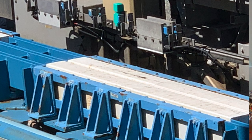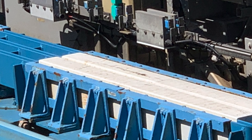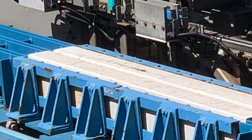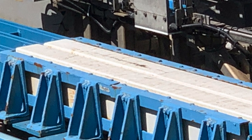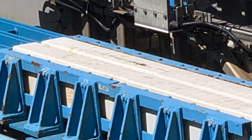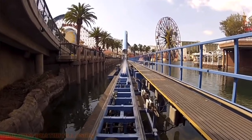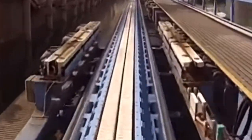The last step of construction on those is the outside white coating that's on them. It's not just paint, I found out very long after I worked there, because I thought it was just paint. It's actually a heat sink compound that's sprayed on the outside. Also very expensive if you were to buy the stuff again. And it's specially applied, so it's not easy to do. But that's actually designed to help the stator cool from the outside with air blowing over it. Or in some cases, I've seen water blown over it too. But water typically makes a real nasty mess with that stuff. So most everything everywhere is air-cooled.